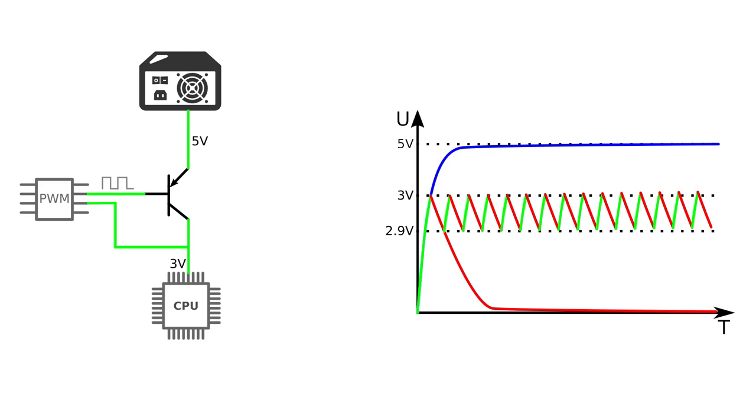The principle behind this circuit is the same as I explained before with a switch, and it is called a switching power regulator. Such a solution is extremely widely used. You will find it on mainboards, graphics cards, in every notebook, and even in the USB power supply which you use daily to charge your phone. It is very useful to know and understand how it works, because it is the number one reason for failing of all the devices I just said.